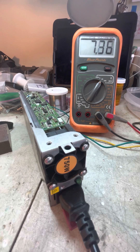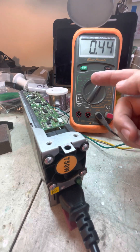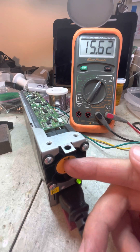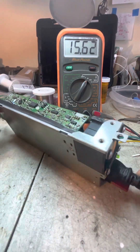We have our green light. Once you do this mod and get it set for your target voltage, unplug the supply and let it drain down. If you don't have your OVP set correctly, what will happen is it'll power up for a split second, the green light won't come on — it'll still show voltage, but as soon as you put any current draw on it it'll shut off immediately. After your mod, unplug it, power it down, plug it back in — the green light should come on, the fan should run on low, and your voltage should pop back up. That's it.